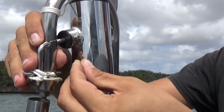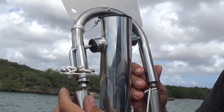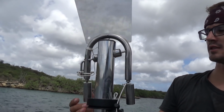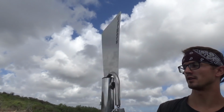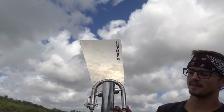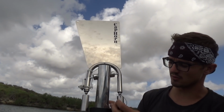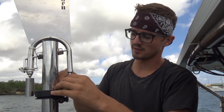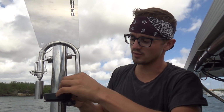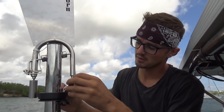That gets locked together, and a piece of bungee cord holds it in. That's it. It goes like that into the wind when you're sailing. This piece of bungee cord right here goes through this little nylon loop. It helps adjust the yaw while you're sailing downwind so you don't overcorrect.